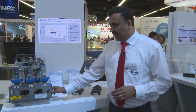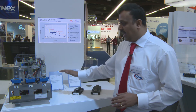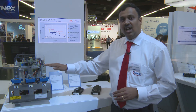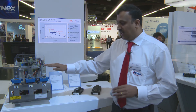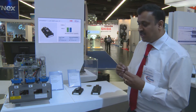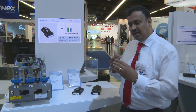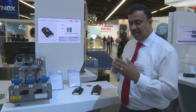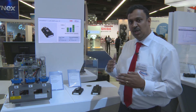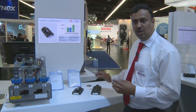Only the module adapter board was modified — nothing else was changed — and with that we are able to get a 30% increase in output current. This is a great benefit to the customer. The customer has two options: either to increase the lifetime or to increase the output power. You can choose between these two axes or anything in between. That is the real benefit of having IGBT5 and .XT technology.